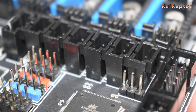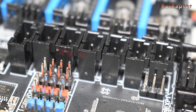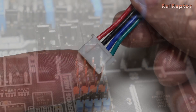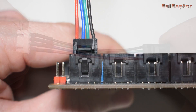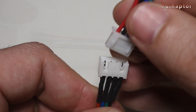The connectors used in this board, however, are not the traditional JSTs. If you are planning on installing or upgrading your board, you need to either cut the existing JSTs and crimp these instead, or do as I do with mine, which is to make small conversion cables and this way avoid cutting the original JST connectors.